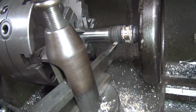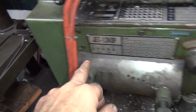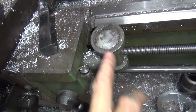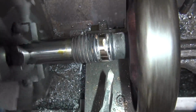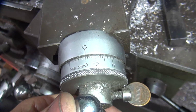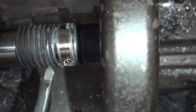Okay, now we can go set our thread pitch. So, the threading, you watch your number over here. Make sure everything clears where we're at. We're good. Okay, we got this set on our A7, A8, which is 7 threads per inch. Which I think is what we want. Now this gets over here at number 1, I'm going to engage it. Right there. So now we're engaged at number 1. And this now moves, see? Okay, now we're going to start moving all these other dials in. So we're going to zero that one out. This in until it comes in on center.